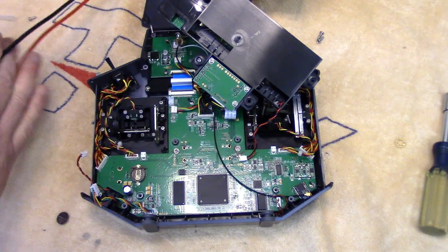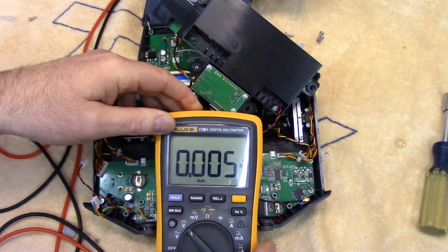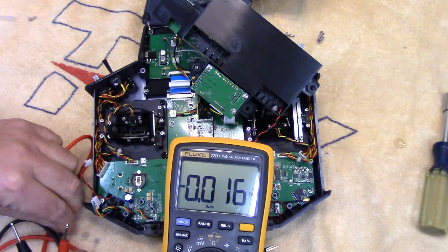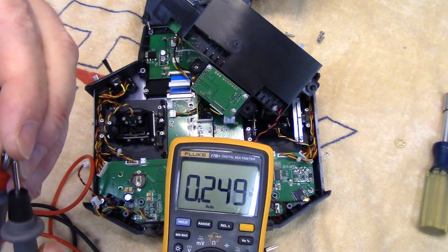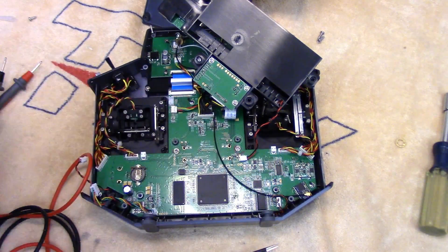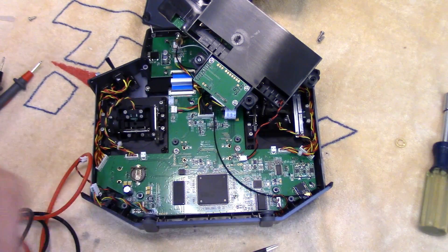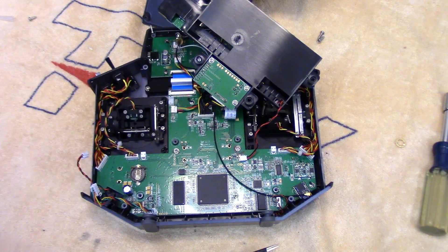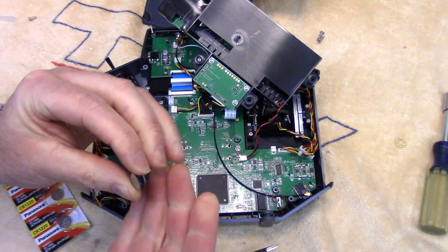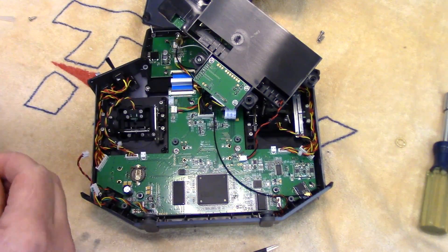Now to test it, if you've got a digital multimeter, we'll go into DC volts and just test the old battery here. 0.24 volts — so yeah, it's dead. Comments below: if anyone's got one of these things, has your backup battery failed so quickly? Mine is three years old and I'm kind of surprised it has crapped out so fast. What's the name brand on this thing? Probably some no-name chinesium garbage. So put a good one in — we've got some Panasonic ones here.